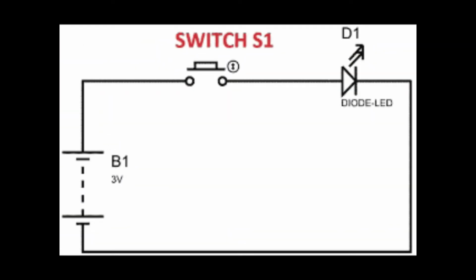So the figure above shows case 1 for 1 second, and we can see the LED being off for half a second. The LED will be on for the other half second. If the frequency of on and off times increases from 1 per second to 50 per second, the human eye cannot capture this frequency. For a normal eye, the LED will be seen as glowing with half brightness. So with further reduction, the on and off appears much lighter.